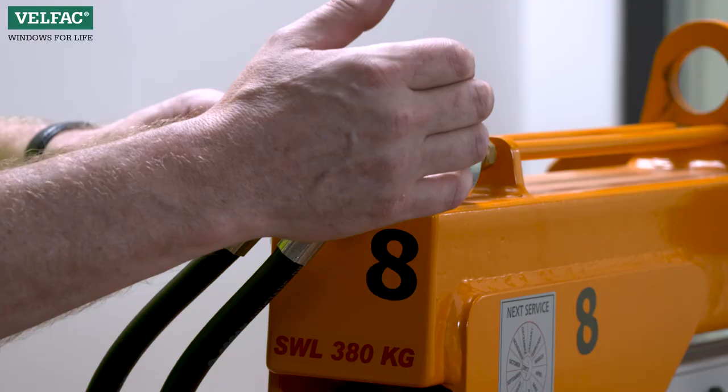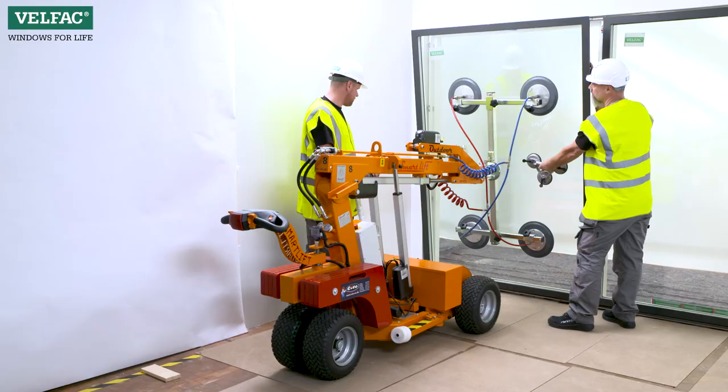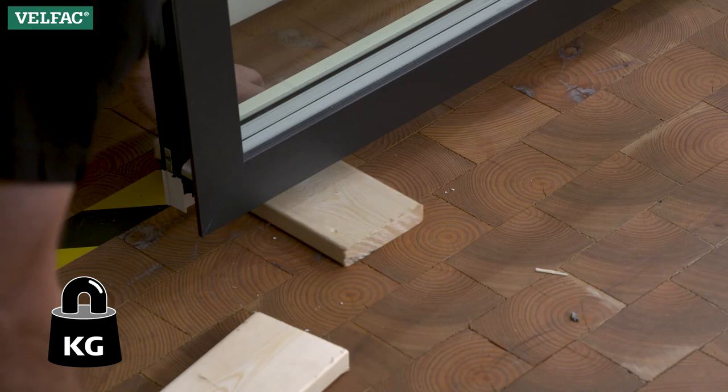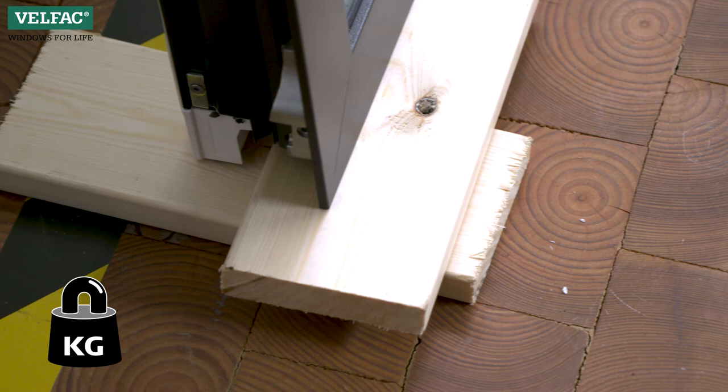Release the safety brackets on both sides by tilting the sash slightly inwards and pushing the fittings upwards. Gently lift the sash slightly upwards and free of the guide rail. The sash must be stored in an upright position and must be packed off a finished floor to prevent any weight being applied to the plastic profiles that form part of the sash.